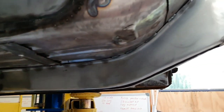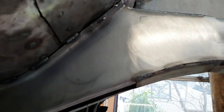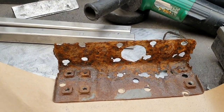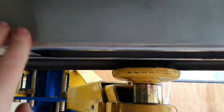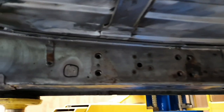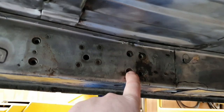There we go — that's not coming out again. I haven't finished with the welding yet but it's sort of welded in there. I've got to do some plug welds — you'll have to forgive me earlier in the video, I was calling spot welds 'stitch welds.' That happens, I'm a human being. Now I need to go and make something like that or an equivalent — doesn't have to be exactly the same but it has to do the same job. Smash that up inside the hole there. These marks I pointed out give our placement fore and aft. The bracket itself will give our height. I can compare to the other side which we haven't destroyed yet, so we know where things are supposed to be. These inside two holes we don't actually use anyway — could leave those out, but I'll put them in anyway.